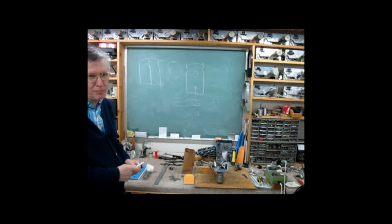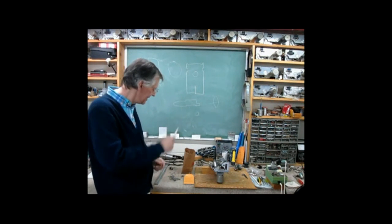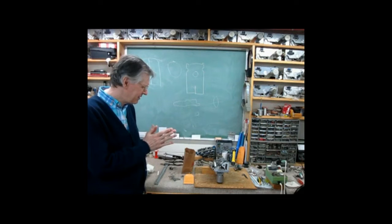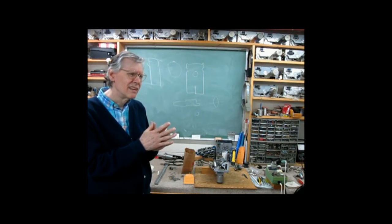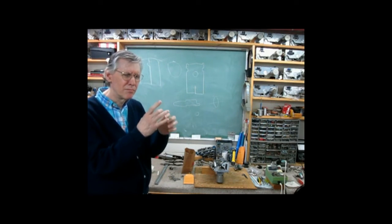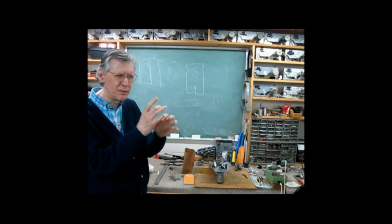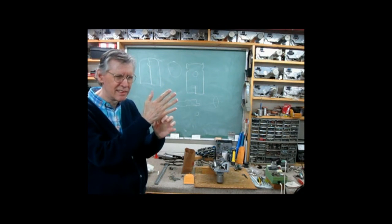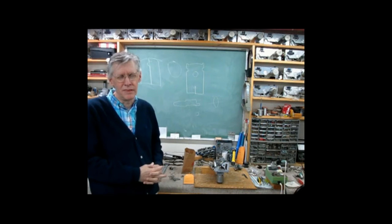Now, that's the good part with this approach here. Now, the downside of that is you have to do this yourself. You cannot, in other words, a head refurbisher is not going to do this because there's calibration involved and you have to have the ability to reset the tip alignment yourself, if you were to go this route, and that's what we chose to do because we were in a position to do this.